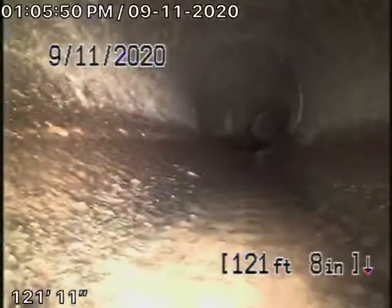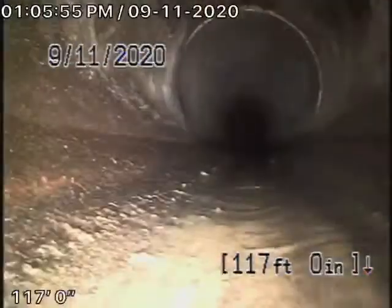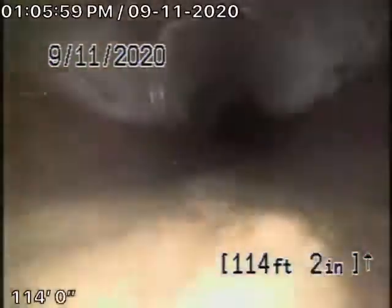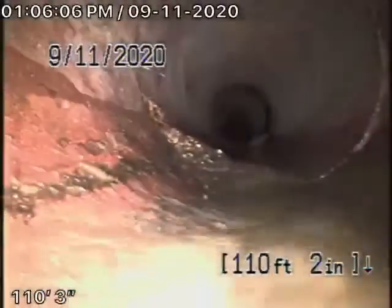There's the city sewer there, and here's your connection to the city. It's a six-inch clay pipe coming back from the middle of the street towards the property. It actually looks pretty clean. There's a little bit of mortar buildup there — that's very common.